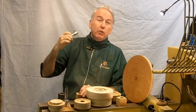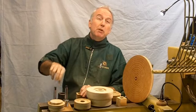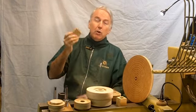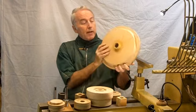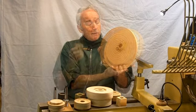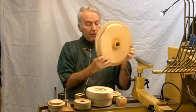But I've now taken it to a new dimension. I purchased a Beall spindle tap. This enables me to make threads that match my lathe's spindle. I started by experimenting with just small blocks and threading them. This is what I used to make this large segmented faceplate. I used this sort of thread as an insert to this faceplate.